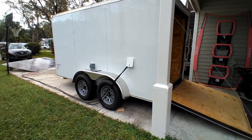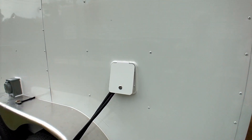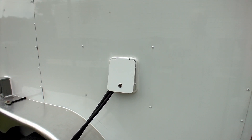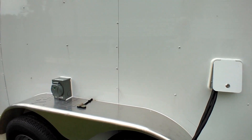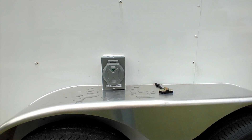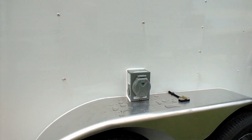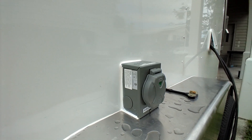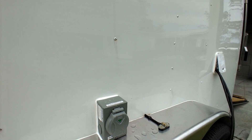Going outside, you can see I've got the hole on the outside of the trailer — the inlet for the PV wires coming in and the AC wire going out — done. We also installed the 50-amp service, 240-volt generator input on the side of the trailer. Got that all wrapped up as well. Everything is labeled and everything is finished up.